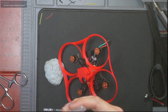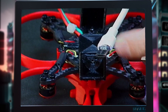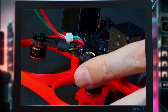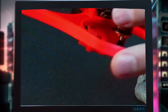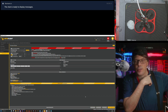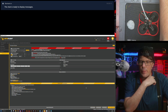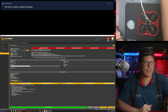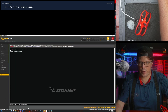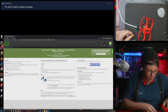The next thing is to set it up in Betaflight. You might need to make your own little custom USB cable — sometimes they have plastic covering that's way too thick; just use clippers to cut away at it until it snaps in. Go to update firmware, auto-detect the board, full chip erase. Turn on a fan to cool the VTX because it can get pretty hot. Once that's done, connect, get the default config file from the website, and paste it in. We actually need to stop Betaflight right now because we need to flash BlueJay — don't forget to do this.